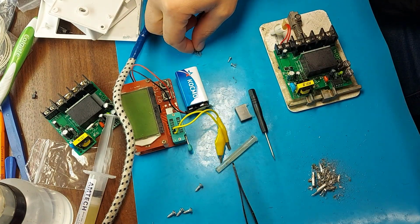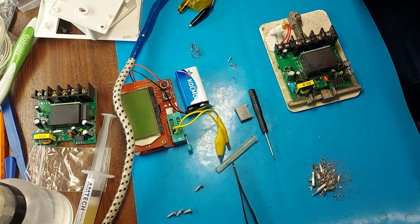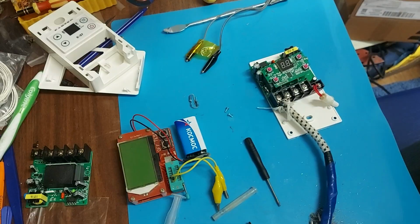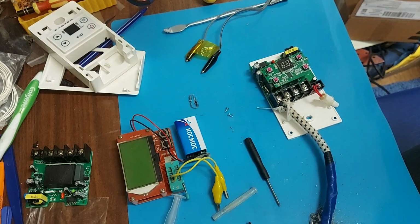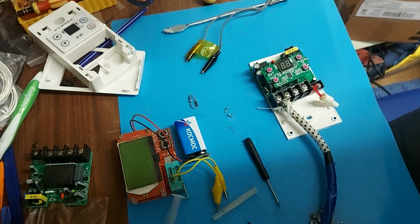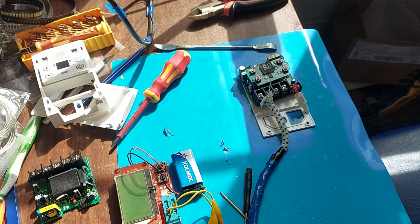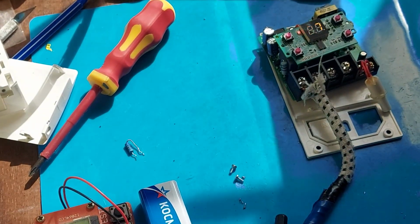Let's try to start this device again by installing a small resistor again, because there is no larger one and I have already ruined the working one. And so friends, let's try to launch it again. Take 3. This time the plug was not knocked out, but something began to smoke and stink. This means there is still a faulty element. This time I also changed the PWM controller and again the input resistor. Let's try to launch it again. Yes, friends, and this time everything worked for us.